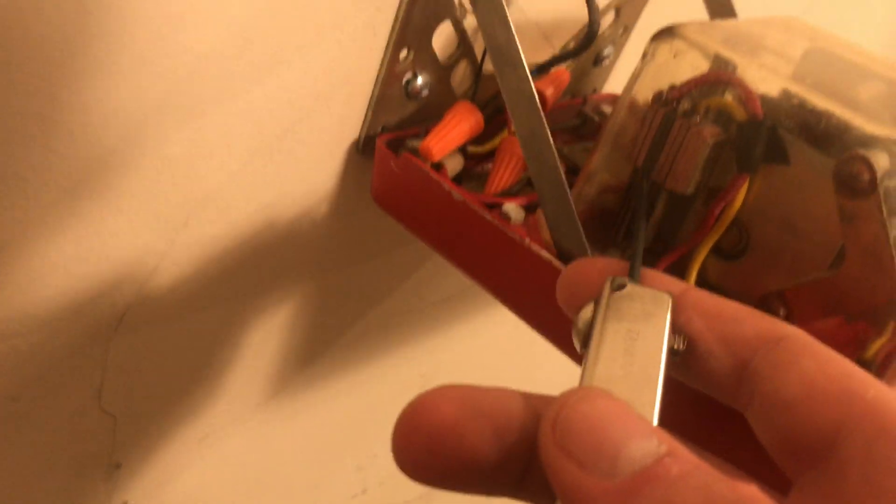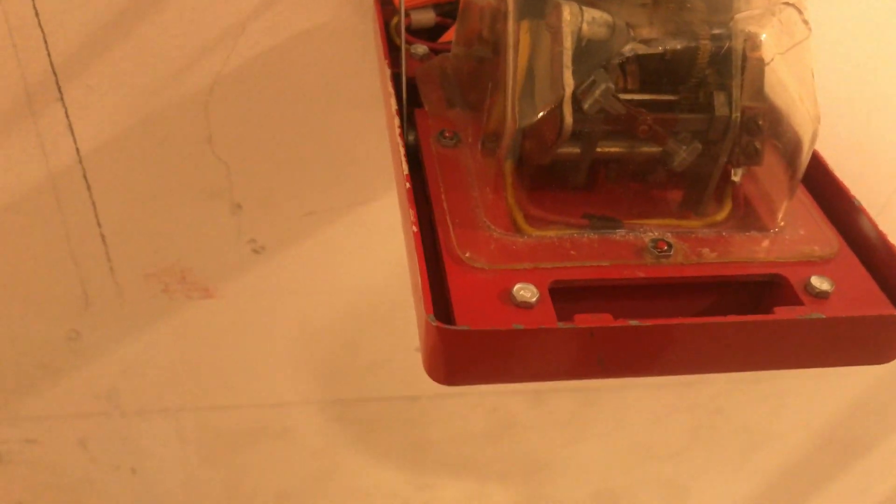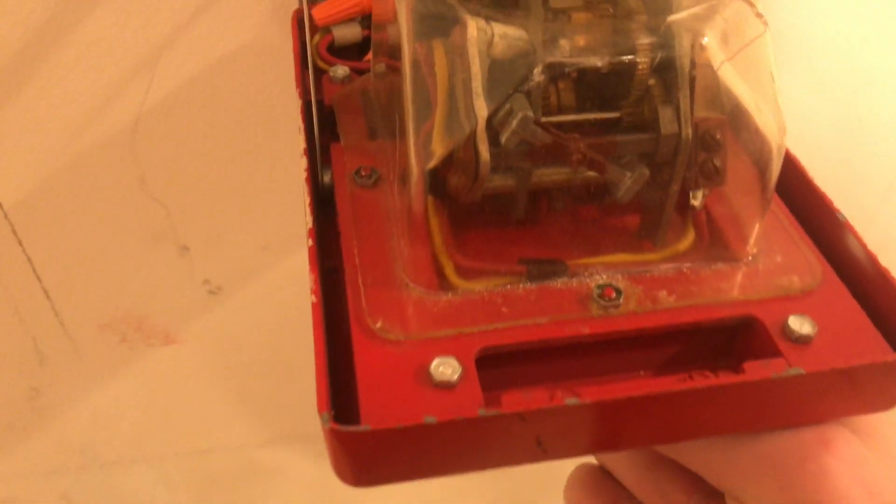Over here is the test and silence switch, and the top part lets you work on it without going underneath. That is the general alarm switch. In there it's just a couple of different sized cogs to transfer the energy around, and then a ratcheting gear so the lever can wind it and then return to normal. I have my hand on the lever and will pull it to wind — you can see everything inside begins to move, it's clicking, and then I release and it starts going.